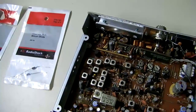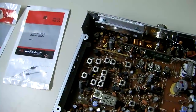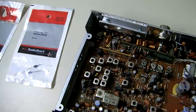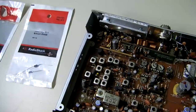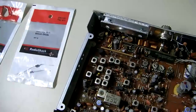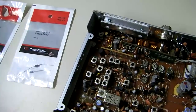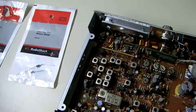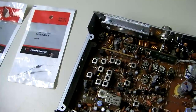The first diagnosis step: you go to power on your radio and it will not power on. Check your fuses, check your install — everything else seems correct. If you have another radio you could try hooking it up, but be careful, because if you've blown the circuit in one radio you might blow it in another. Check all your wires, check your fuses, and see where you're at.